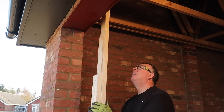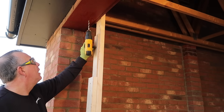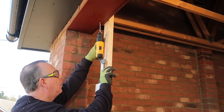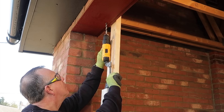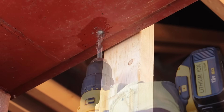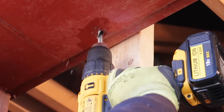Before I get multiple comments from viewers telling me there are magnetic drills on the market made to carry out this exact job, I'd just like to say I know — I've used most of them in my day job in the construction industry over the last 30 years. However, I don't own a rotary broach-type magnetic base drill and I'm reluctant to spend over £100 a day hiring one unless I really have to. The bottom flange of this beam is around 10mm thick, but it's got another steel plate welded to it, so I'm actually drilling through 20mm of steel in total. I kept using oil to lubricate and keep the bit cool, although at this low RPM it really didn't heat up much.